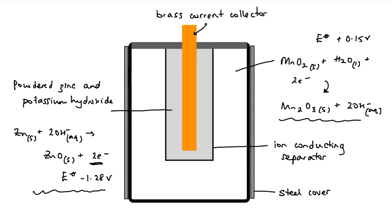This cell lasts far longer — up to maybe 16 times as long as the zinc-carbon cell. We also don't have the problem of the zinc casing being slowly corroded, we don't have the corrosive electrolyte leaking out, and we don't have the production of gases. So in reality it's actually a simpler setup.